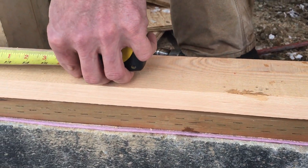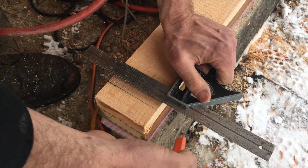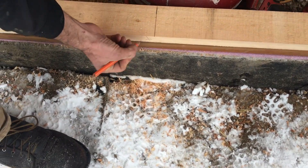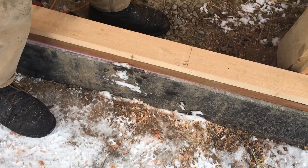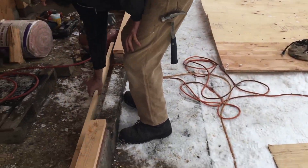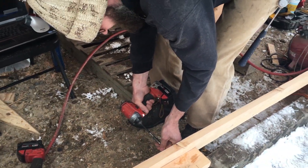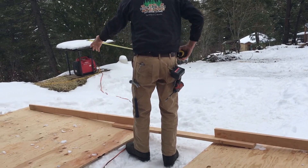Without a printer I tend to check my computer quite a bit. I don't walk around with a printed drawing. I just keep my computer on hand to see how I worked it out in my imaginary space and try to make it match the real space. So I'm transferring all of my markings to the front side of the wall. I will start framing this face up, meaning the outside face is facing the sky. With the door opening like this, some people will just cut one long sill plate and then cut it out after it's stood up. I don't have a lot of 12-foot lumber so I'll make my two separate pieces and make them live as one while I'm framing the wall.